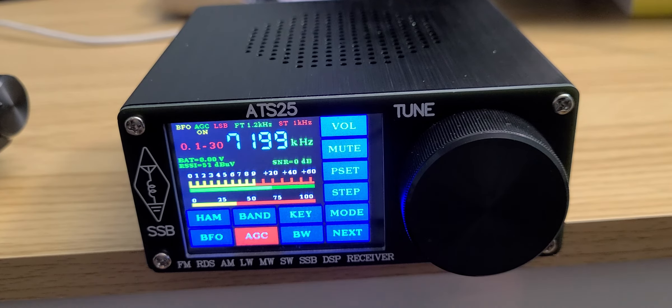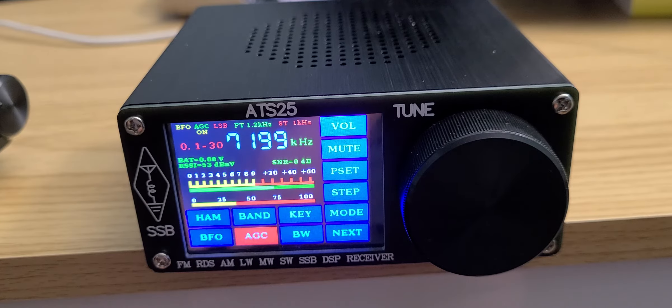Performance on shortwave is good — I like it. I love using this for its uniqueness, and the display is, we have to say it, very beautiful. Medium wave has a lot of internal noise. Longwave is a horror story — more noise, overload, and all sorts of weird things. If you use this for longwave, you're not going to like it. Medium wave depends on your antenna, but it's not always the best. It doesn't have an internal ferrite, so it needs an external antenna even for longwave and mediumwave.